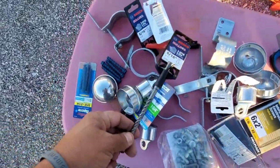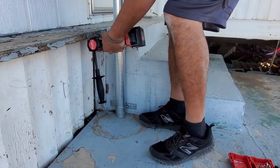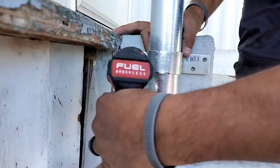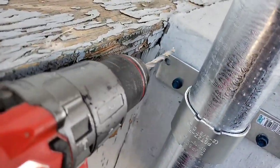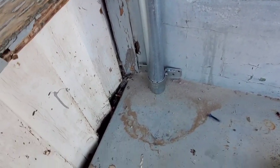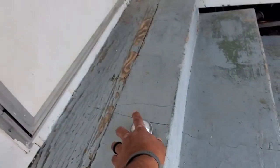Fun fact — the guy at Lowe's told me to get a certain drill bit, but it ended up being too big. You really need a one-fourth inch bit to step down for the masonry screws. I used the metal bit to get started, but it sounded terrible. I absolutely smoked that bit — it's done. I used it as much as I could and actually got my four holes. It seized out on the fifth hole and keeled over. My wife went into town to get a new one.